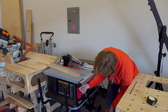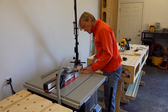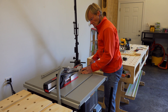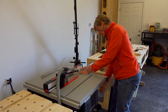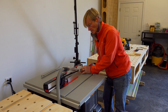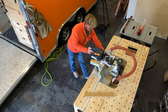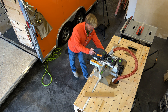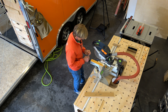I needed a piece of aluminum ripped for the slider on the bottom of the circle jig. I had a piece of scrap and had to run it through the table saw, but because of the brake on the table saw metal will cause the brake to trip. So I put it in bypass mode — simply pushing the button above the power switch, holding it until I get one flash of red light, then flipping the motor on and making sure the green light is flashing. In normal mode it's a solid light, so the flashing green confirms it's in bypass mode and that it won't trip the brake.